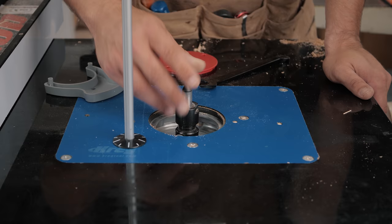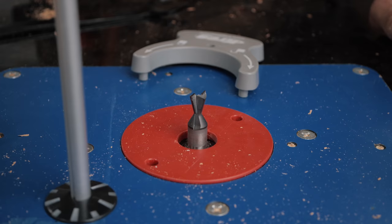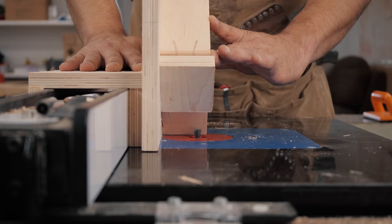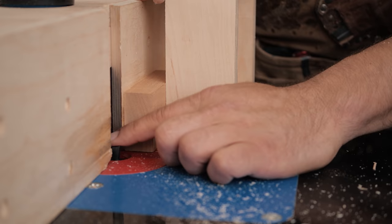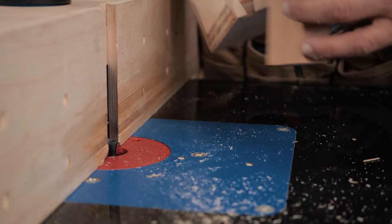The next type of miter spline we're going to do is a dovetail key, and we're going to try something cool — one that's a regular dovetail, and then we're going to try an inlaid one. I'm using these really cool astro-coated dovetail bits. There's a 15% off discount code in the description and pinned comments. We're going to do basically the same thing we did with the saw blade. These are really simple keys to cut — you do not want to change the height of your bit after you cut the slots, and you just keep bumping your fence over until it fits perfectly.